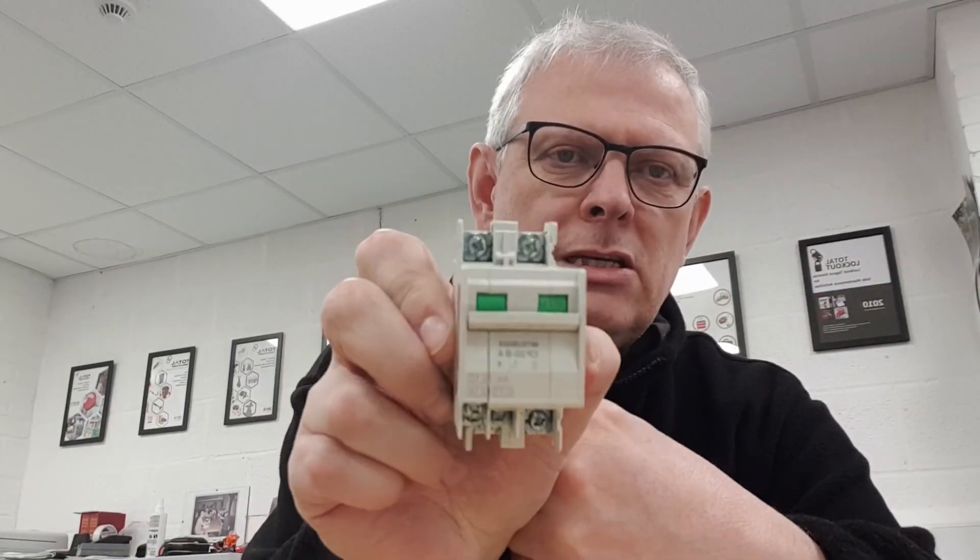Just to recap: this is a 3D print of sufficiently good quality that it is actually a viable production product. That makes 3D printing ideal for what we describe as low batch, short-run production. If the quantity demands of this product start to escalate beyond a few hundred, we'd look to a plastic injection molded solution. And there you have it — this is the circuit breaker lockout device for the Mitsubishi CP30BA circuit protector.